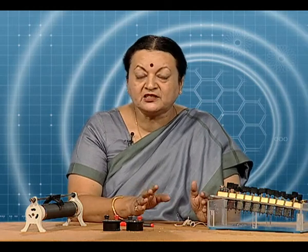This makes it a very important standard resistance box. The material used for making this is constantan or manganin — again for the same reason that they hold the resistance value at different temperatures, making them very important.